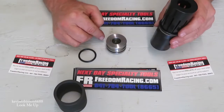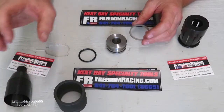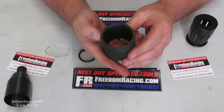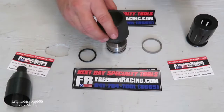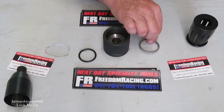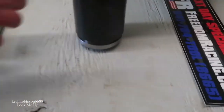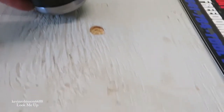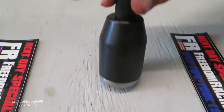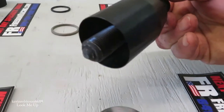Once we have the ring in its position where it needs to be, we're going to use this tool as a calibrator. This is tapered — it has a very hard taper on it. It's going to go right down over the top of this and squeeze this seal right down inside there the way it's supposed to be. There's a little hole that we drilled in the table the last time we did this — the little tip on the tool goes right down inside that little hole, and that kept it from rocking back and forth. That did help us out.